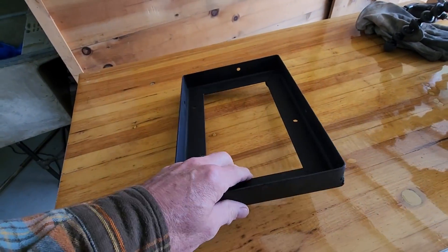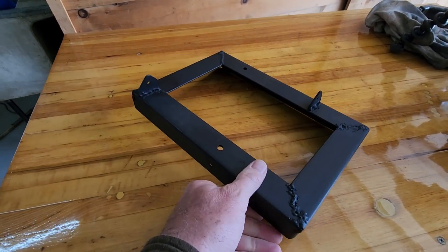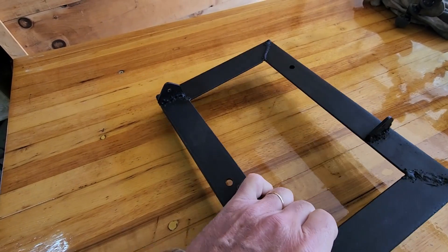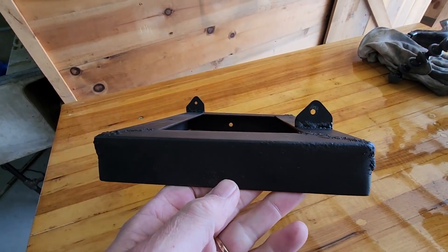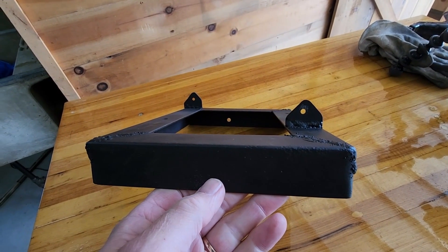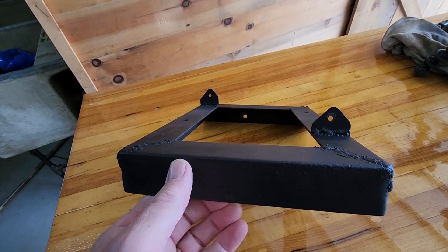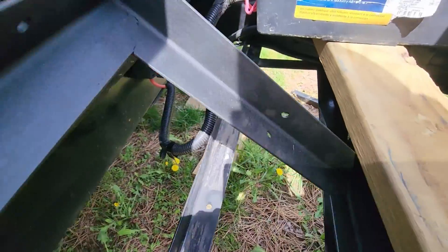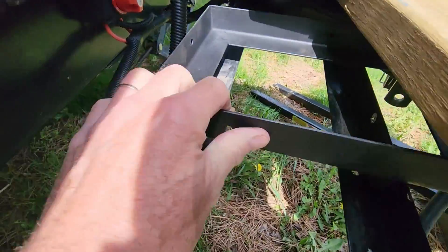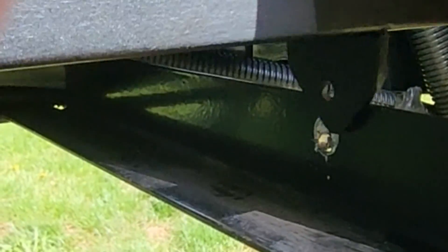Here's the battery box — I have the tray ready to go on there. I welded these two tabs on here; my camera was off while I was doing that, so you missed that part, sorry. These tabs are to attach it to the other frame rail, or the other battery tray that was going crosswise on the tongue — this will now be sitting perpendicular to that. Let's go fit it up and see how it works. It goes right in there like that — there's one of the tabs there.